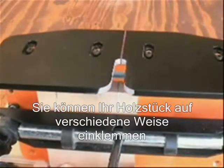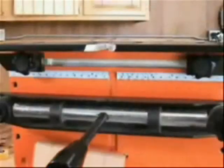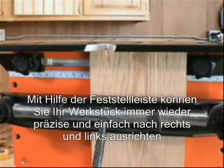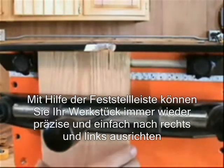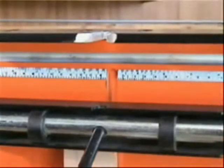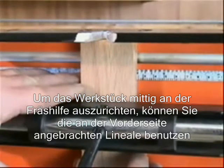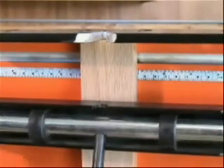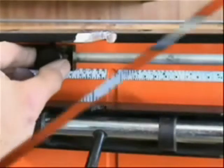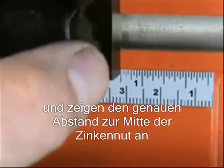You may locate material on the N-Lock a variety of ways: by using the center line of the N-Lock table, or by using the N-Lock stop system. The stops provide accurate, repeatable, and easy right and left alignment of your work. You can center material on the N-Lock jig by simply using the left and right rulers built into the face. The rulers also provide a means by which to set the stops, indicating the precise distance from the center of the dovetail socket.